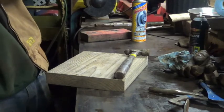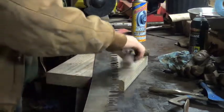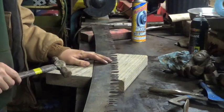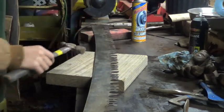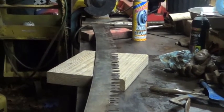The straighter you have the saw, the cleaner it will go through the kerf cut, the less drag you'll have, and the more efficient the saw will be. So it's definitely worth putting in the time and effort to make sure you have a straight saw.